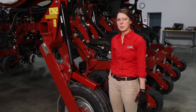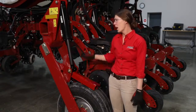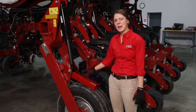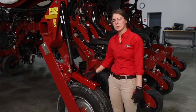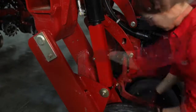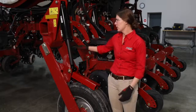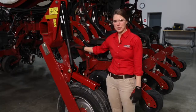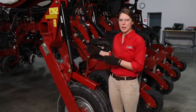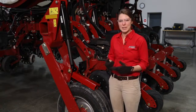When your planter is ready to be placed into storage, make sure all of your safety stops are installed. On the 2150 specifically, all cylinder stops are going to be placed on the outer cylinders of our center frame. On the 2150 and 2160, we can fully lower the cylinders onto the cylinder stops by placing the frame into storage mode in the remote valves frame tab.